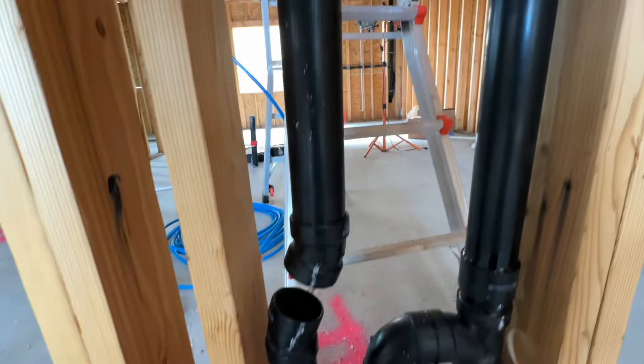You might also see that on some of the pipes I have a white paint marker that I use on a lot of these black pipes. Whenever I'm doing plumbing I use this to mark my cuts because it's a lot harder to see other types of markers on black pipe. I really use it as a reference line to make sure these angles are all facing the proper way. I'll line up all the pieces visually to make sure they're sitting in the right orientation and the angles are going to be on the same plane. Then when I have everything dry-fitted and sitting right where I want it, I'll go on there with that white paint marker or a silver Sharpie and make reference lines across those edges, so that when I go to glue everything I can quickly find my reference marks and have everything lined up the same way it was dry-fitted.